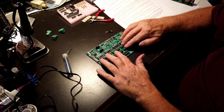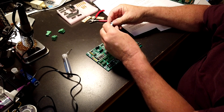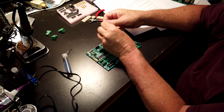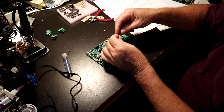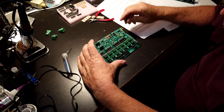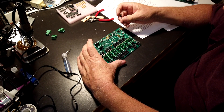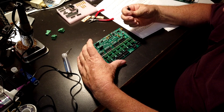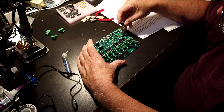There's all 16 of those. Now we're going to put the regulator in — this is the one we put the nut and bolt on. Let's take those back off. It fits right over here and the metal side of it has to go down. Don't get it in backwards because it's kind of an L-shape, and you want the flat side down against the board.